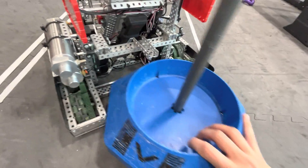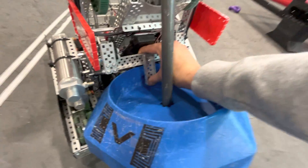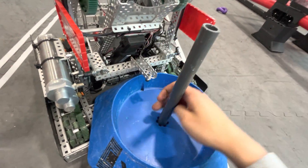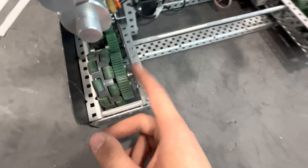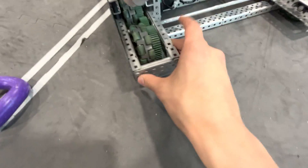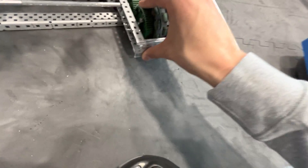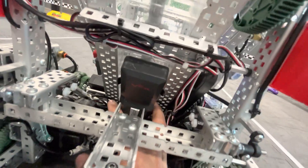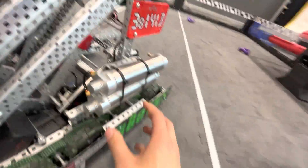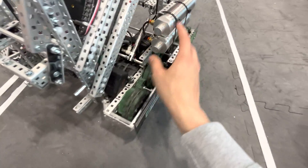Back lift is pretty typical. I have a different video where it's like the two-piston mogomech joke video talking about it — same thing, smaller and lighter. Another thing with the drive train: I ended up going with high-strength gears because I had a low-strength gear break on me once and I did not want that happening again. Down in here the motors are compact, got the inertial sensor, and the battery's in a good place — can't get unplugged, it's secure. Tank placement is further to the back, helping with center of gravity.